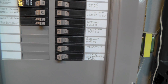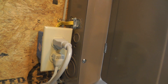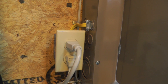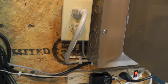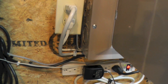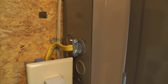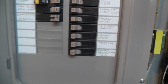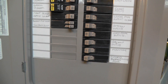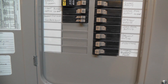The other problem I have is an external outlet which feeds right in at the location where I want to put the surge protector. I'm probably going to move this outlet down, because all the wires under here seem to travel in that area. If I slide it down, that'll open up a hole for me at a knockout, and then I can rearrange what needs to be done and install the dual 50 amp breaker for the surge protector here.